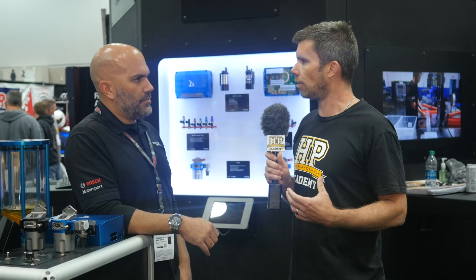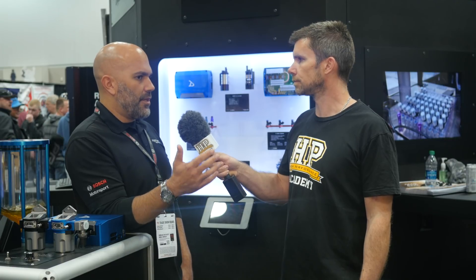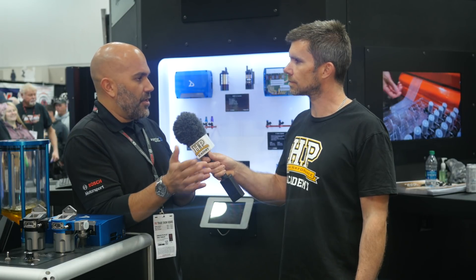On the flow rating: we call it the IDF750, rated at 750 litres per hour, and it'll accept a reasonable contaminant load before needing service. The more flow you have, the less contaminant load it takes to hit that 5 PSI pressure differential. On the website there's a chart showing flow versus contaminant load versus pressure drop. You could run it at 1000 litres per hour, but it'll need service a little more often. Ultimately how often it needs service depends on how dirty your fuel is, so there's not really a set time or mileage number.